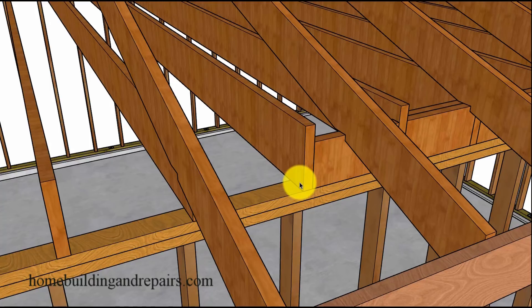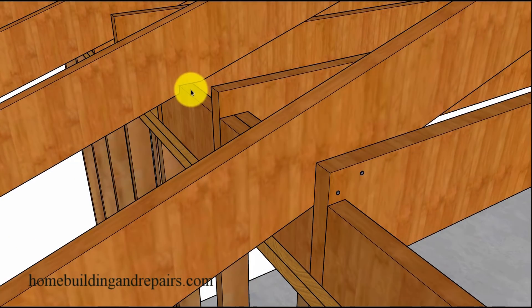Here's my first idea: you will remove the ceiling joist and the framing plate that the rafters are sitting on top of. You could do it in sections — cut out a section, cut out the section on the other side, and go from there. Then you simply add some blocks. Here's one method where you add one block — I think this is a seven-inch wide block — and you can double them up.